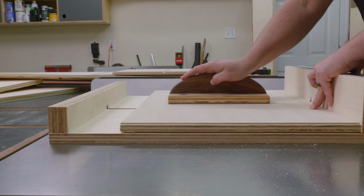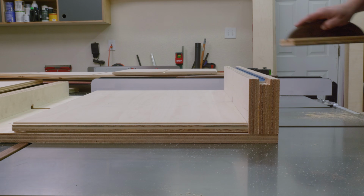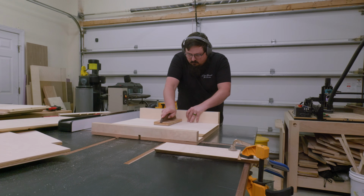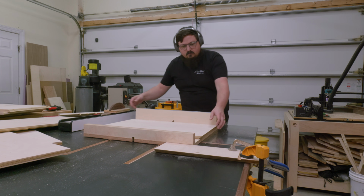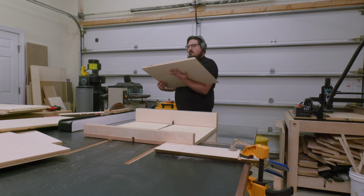Just make sure to obviously test this before you go to your actual workpiece, and also leave about an 1/8-inch gap between where you want that stop line to actually occur so you can carve that area out and flush everything up. Just don't do like I did here and get stuck in your own head about what to do next. You gotta pick it up, go over to the bench, and use your chisels to flush that up.